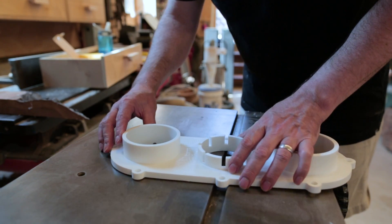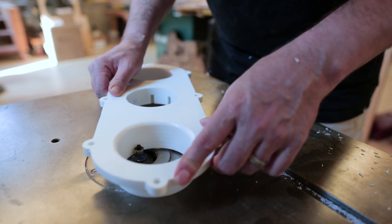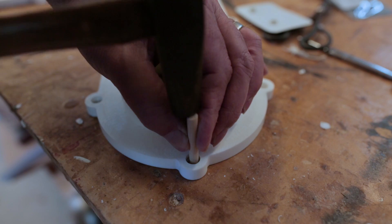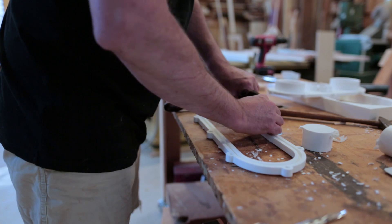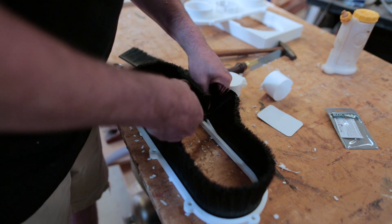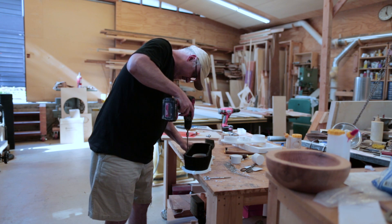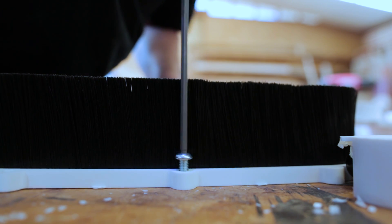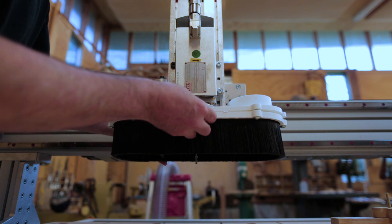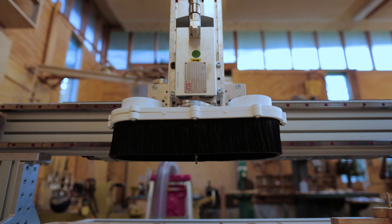The undersides of the air intakes I wanted to round over, just to help the air move up into those tubes. Then I rounded over the top edge of the other side of those tubes as well. Then I could put the magnets in. The thing with this plastic is you can't really glue anything to it — nothing sticks to it — so everything has to be friction fit. The magnets are held in with friction and the brush is held in with friction. The screws will be attracted to the magnets in the upper half, and that's what will hold this up. I was beginning to notice at this point that I was getting some bending in this piece because I had removed so much material — it's almost like there's stress in the plastic. The brush isn't really sitting flat against the upper piece like it should.